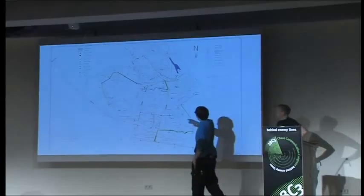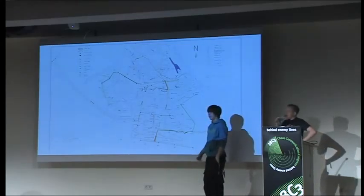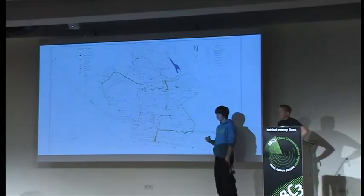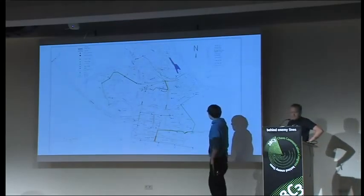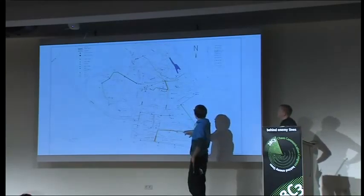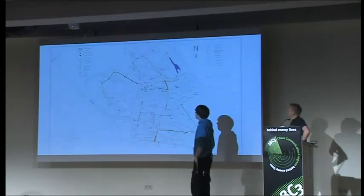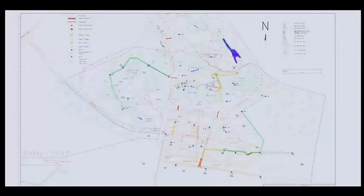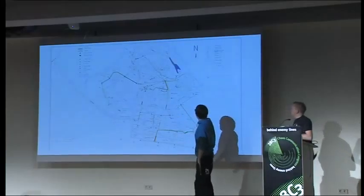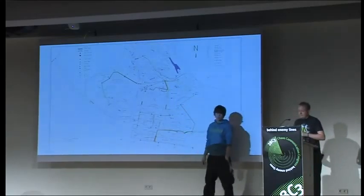We have a single mode 10 gig link running around here, which was a ring. We run the Hyperring protocol, which is a redundancy protocol of Hirschmann. They run beacons every 10 milliseconds, and if one link fails, then it swaps the whole ring to the other side. Here we have a 10G spoke, and we ran single mode fibers here. Most of the fibers on the campsite were multi-mode, except the whole ring around the F area. The blue things are all the data flows, and we have 3 cable bridges up here, and we rerouted stuff because here they want 10 gig, so we laid an extra fiber around the Angel area to our data center.